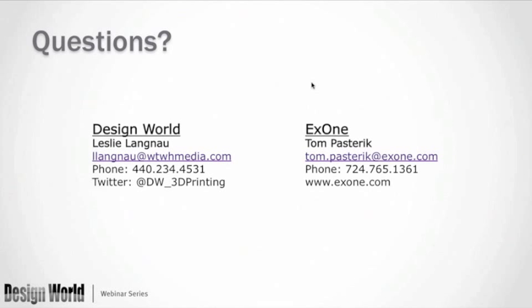Okay, here's another question. How do mechanical properties of a 3D printed part differ from those of a machined part from, say, a solid material like aluminum or steel? Is there a difference? Whenever it comes to EOS machine or Renishaw machine, I cannot speak of their materials. I do not know their material properties. But with ExOne's stainless steels, they are 420s and 316 stainless steels that have been infiltrated, and they meet or exceed the traditional standards of a 420 traditional stainless steel bar stock. So that's in tear, shear, tensile, and compression.